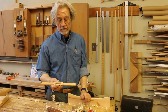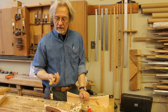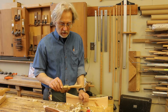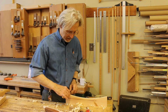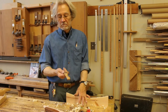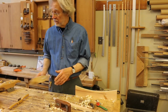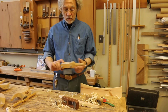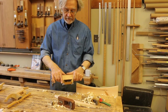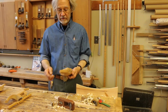And it's often used by chair makers to smooth spindles and other chair parts where the spoke shave would just continue to tear out. It doesn't work on softwoods particularly, but it's particularly marvelous on hardwoods and figured woods. Pretty easy to make. Another alternative, especially for larger areas, is the buckhorn scraper, so-called because of the shape of the handles. Used like this. Looks somewhat familiar to a travisher.